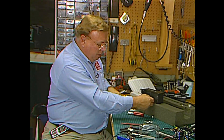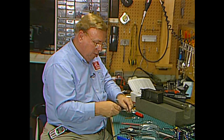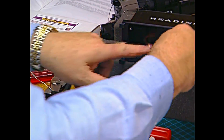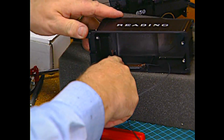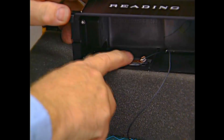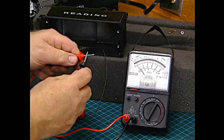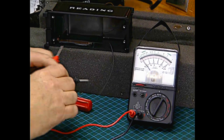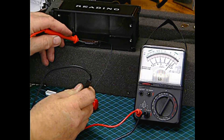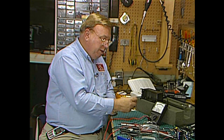Let's measure the foil — it's too long, so we'll cut just a little bit off so it fits within this tender's body. Let's peel the strip and apply this nice and tightly onto the tender wall. Now that looks good, but we need to check to make sure we have electrical continuity. Using a voltmeter set to ohms, touch the contacts to confirm a needle swing. Then we'll take one probe and put it on the wire and plug and the other probe will touch the tender body. That tells us we have an electrical contact and the tender shell is indeed our antenna — we have continuity between the antenna plug and the body.